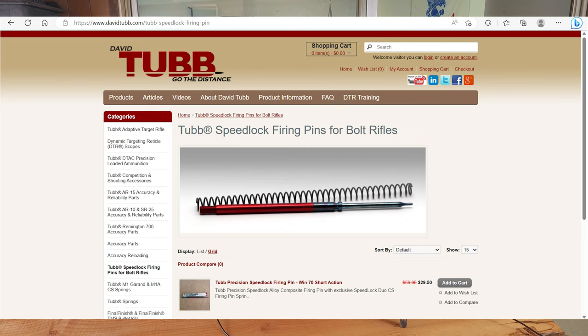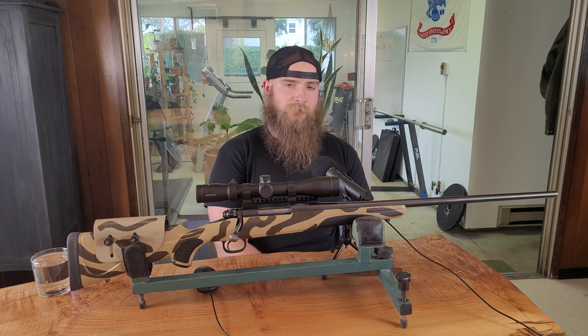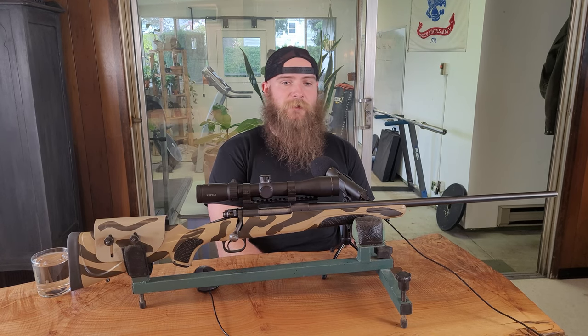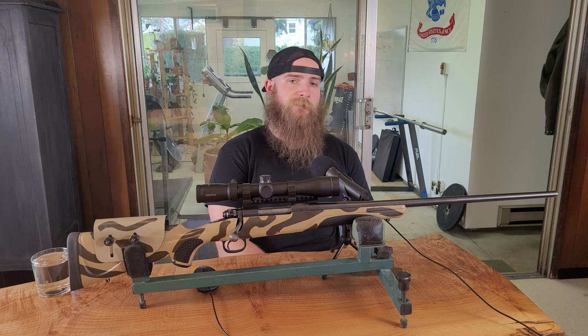The Speedlock system includes a firing pin made from a proprietary aluminum alloy with a heat-treated 4140 steel tip. This makes it very light, and when coupled with the special CS spring, it reduces the travel time of the firing pin by almost 40%. This reduction in lock time effectively speeds up the internal movement of parts, so when you pull the trigger, the firing pin is struck faster, reducing the likelihood of a miss because of shifting aim while firing. All I needed was a new cocking piece, but because the factory pin was basically pinned and welded to the old cocking piece and had been bent slightly, I decided to purchase a firing pin spring combo as well. Together this all cost $120, which was less than the $505 sticker price for a new OEM bolt.